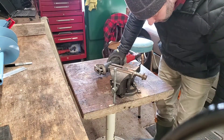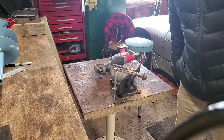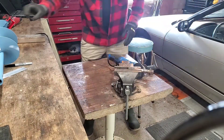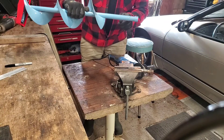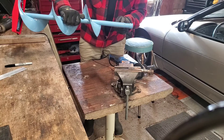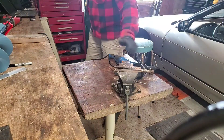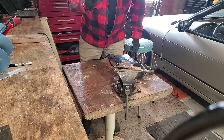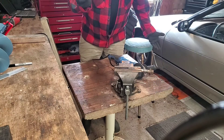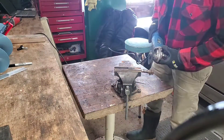The blade is a little tired so I'll switch blades and see if I can cut better, otherwise I'll lop it off with a grinder. I wanted to keep as much of the bolt flange as possible down here because I considered tapping an additional hole through the auger shaft for extra strength as a backup plan. The weak point will be the pin that fastens them — that could shear — and having another one in there would make me feel better about it going through the ice.